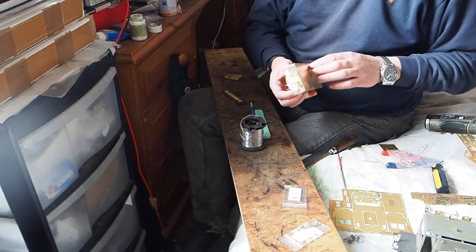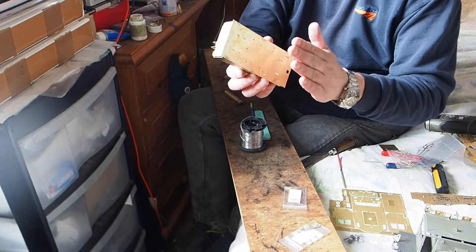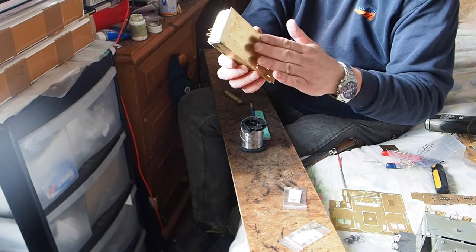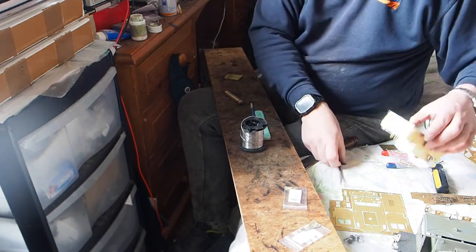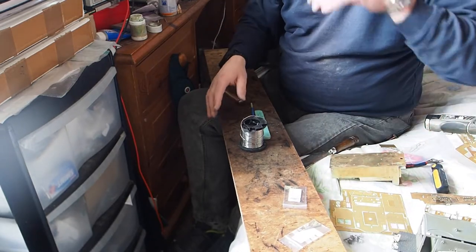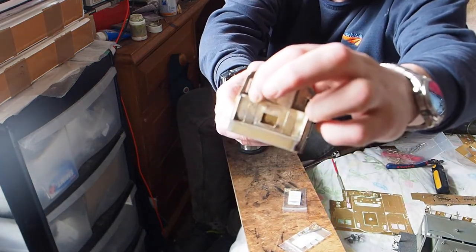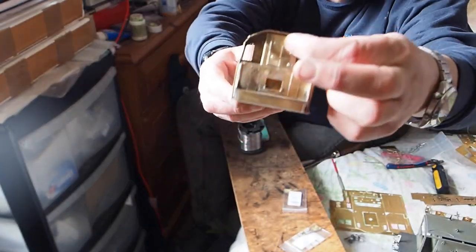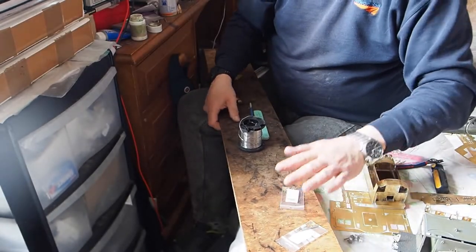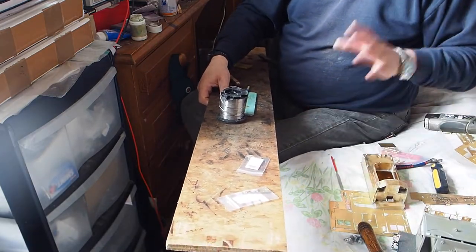And there are two siphons for the tank for the water fillers, which need to go on this. And we'll do those as well if we've got time. So I'm going to go away. I'm going to drill these holes. These ones are 0.85 and these ones are 0.55, to take the brass rivets.